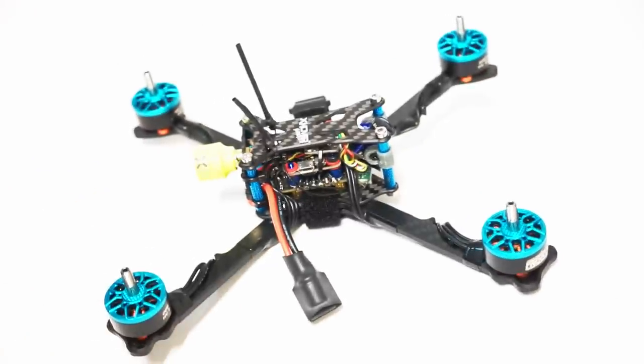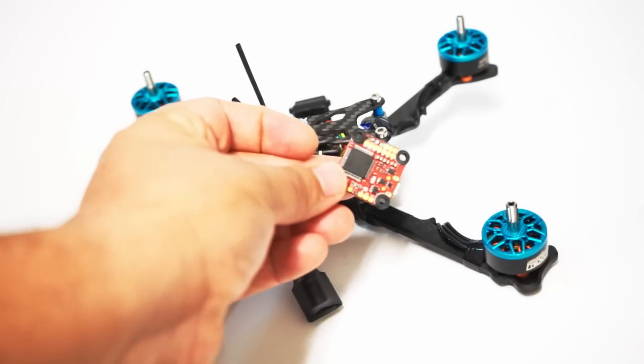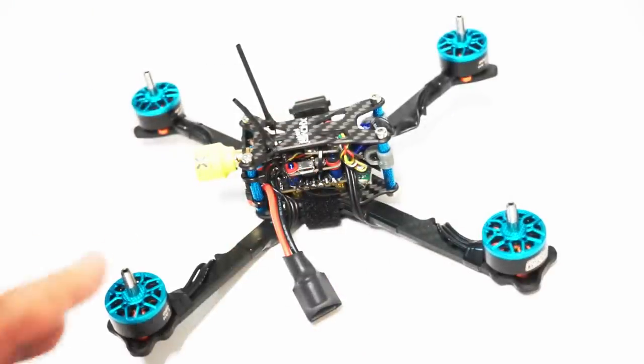Now, the Akon has an interesting flight controller setup. The pads are a little small. They're larger than something like the Mamba Mini Micro Stack, that is, you know, microscopic pads, but they're not as nicely large and luxurious as something like the HeliNation Talon series. These are the gold standard for 20x20, but this is definitely serviceable and it works well. It wasn't hard at all to get it wired up.